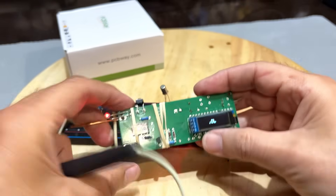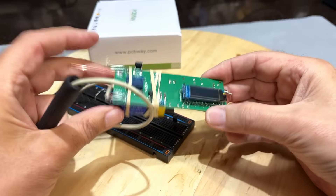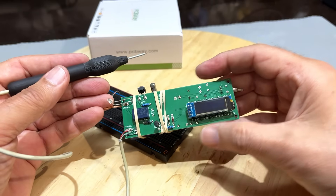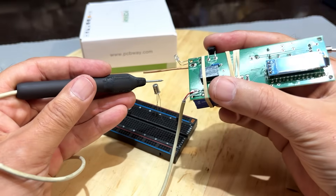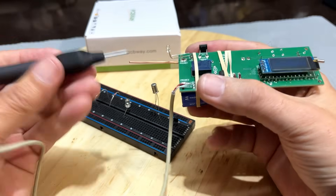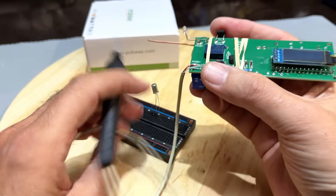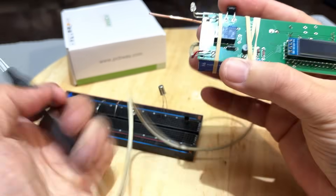The result, in a rather strange demonstration with this monster in my hands, shows that the concept works. I did try it on an amplifier board and it works perfectly well in circuit as well. A few shortcomings: obviously this is not a proper probe, and when I first touch it, it sometimes doesn't make a perfect connection, so you get like 0.1 volts and it beeps as a germanium, whereas it's actually a short circuit. That's easily overcome - just improve the probes.